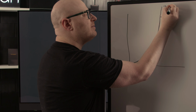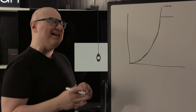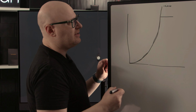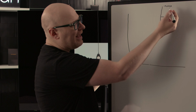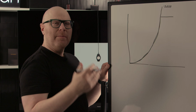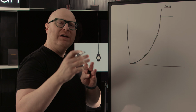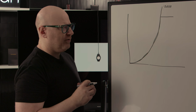But today, displays don't hit 10,000 nits. In fact, I don't think at the shooting of this video, any consumer TV sold today hits 10,000 nits, and certainly not at the 10% window we're measuring here on the Panasonic display. So what does that mean? Well, content, luckily, doesn't really get mastered at 10,000 nits. There's been some demo content and some experiments, of course, at 10,000 nits, but for the most part, content's mastered on mastering displays around 1,000 to 4,000 nits. There's a few outliers there, a little bit higher, a little bit lower, but most displays today are between that 1,000 and 4,000 nit range.